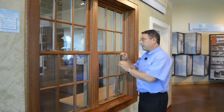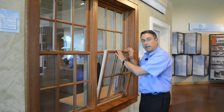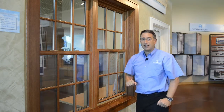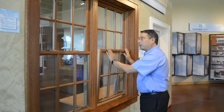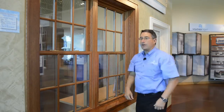The third thing that might be happening is sometimes after you've washed the window and tilted it in for cleaning, you may have one side that's latched but the other side not latched. It may look like it's latched, but it's not pressed in all the way. What you can do here is simply pretend that you're cleaning the window and then just firmly snap it closed, then push the top sash up, the bottom sash down, and lock the window.